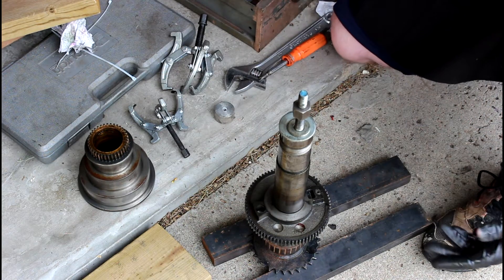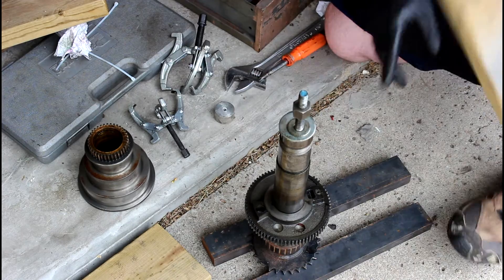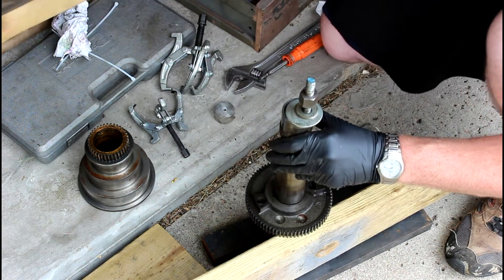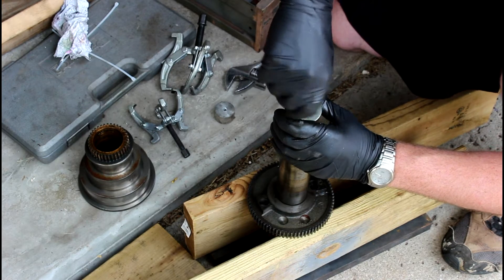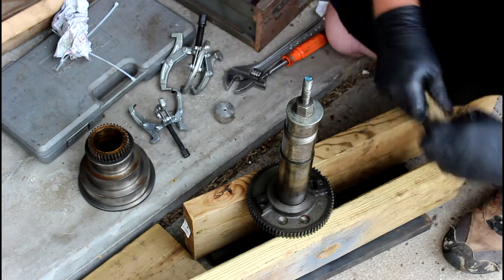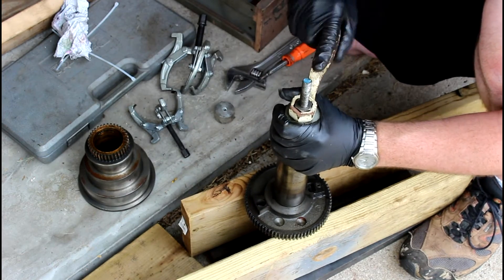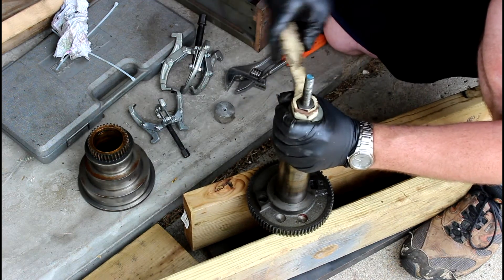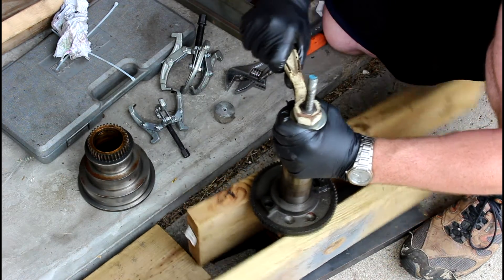Okay, now here's the magic. We want to put something in between our gear here and our bull gear, so we're going to lift this up — set that there. This is just a couple hunks of two-by-six, same thing on that side. We're only going to get about maybe an inch or so. We're going to try to center this guy up best we can. Okay, it's tight — now we're going to crank and that guy should pop. There we go! I bottomed out with my two-by-sixes.